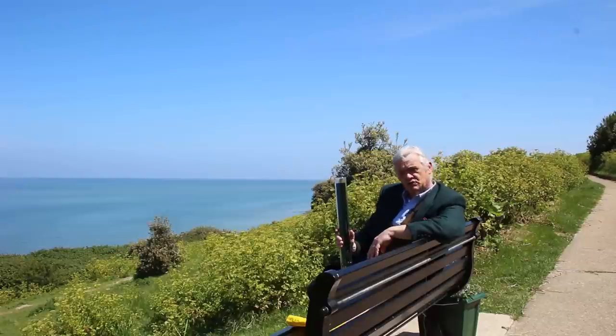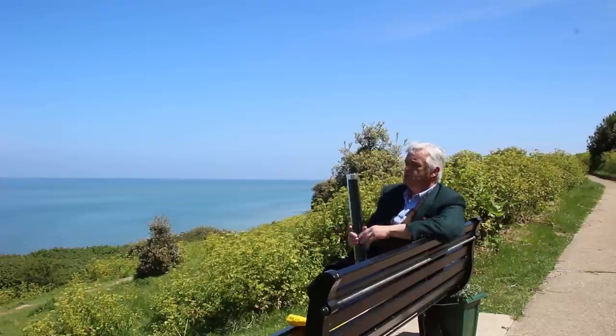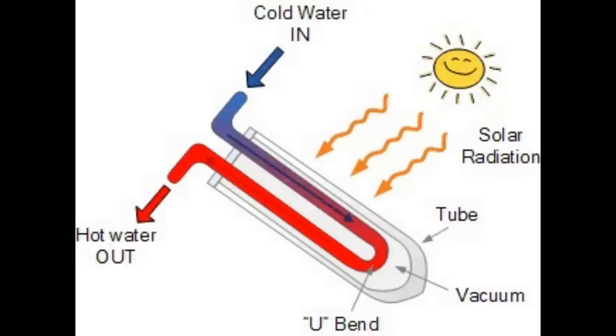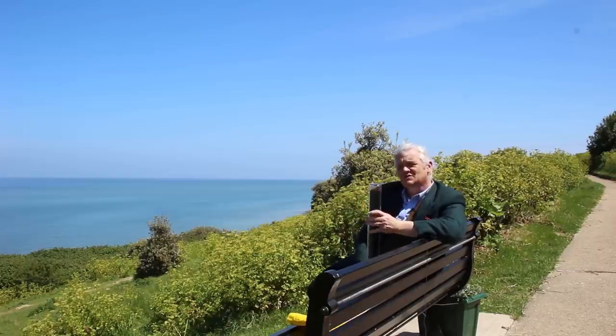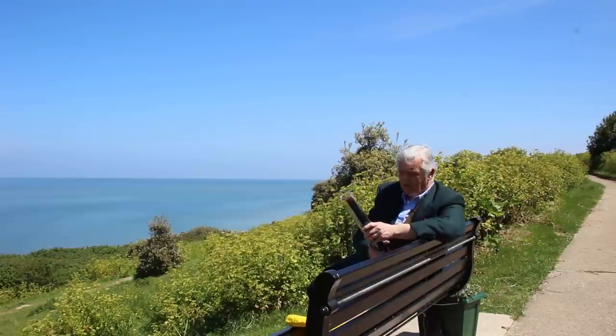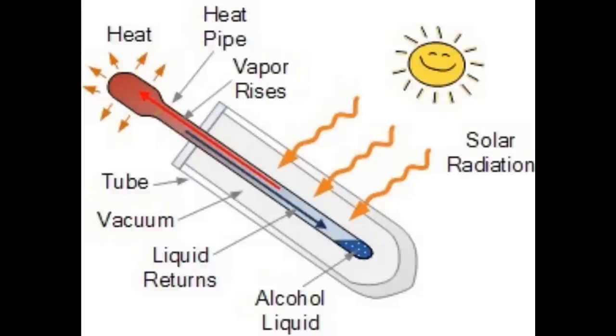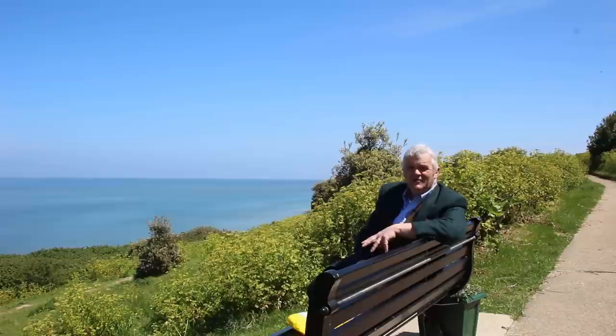Now you don't often see them used just like this — this is a conversion tube. What you see is a piece of copper pipe going as a U, going in and out: cold water in, hot water out. That's the very basic of it. But you can use something called a heat pipe. A heat pipe is just a bit of copper tubing with a bulb at the top filled with a liquid that evaporates at a low temperature, something like isopropanol alcohol or even better acetone, and you can make them yourself really easily.